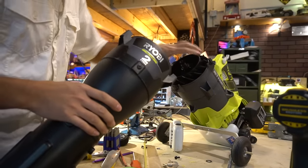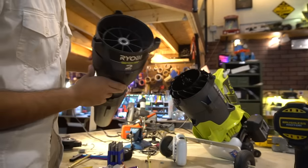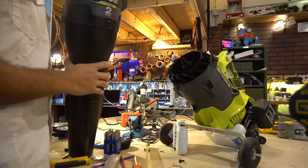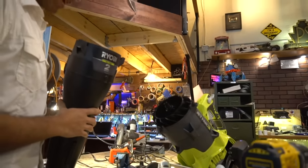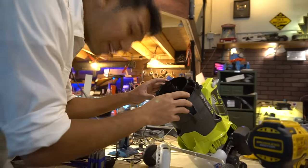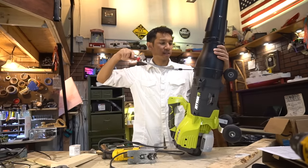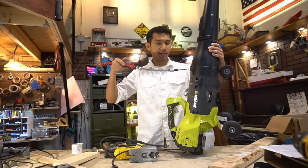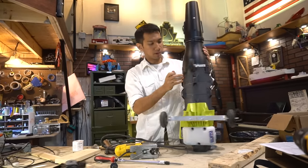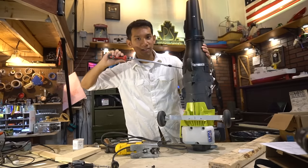Cool, look at that. This is the second stage of the fan. There's a bearing in here. It looks like this is support on this piece, so that's definitely not coming out, so this is going back on. You can't just take the whole second fan off, because it's interfaced as one piece. We'll put this back on. Okay, since we cannot take that stage off because of the bearing interface and how it's designed, it looks like the first configuration wins without any of this baffle here, at least for maximum static thrust. So we're going to go ahead and lose this and start the montage.